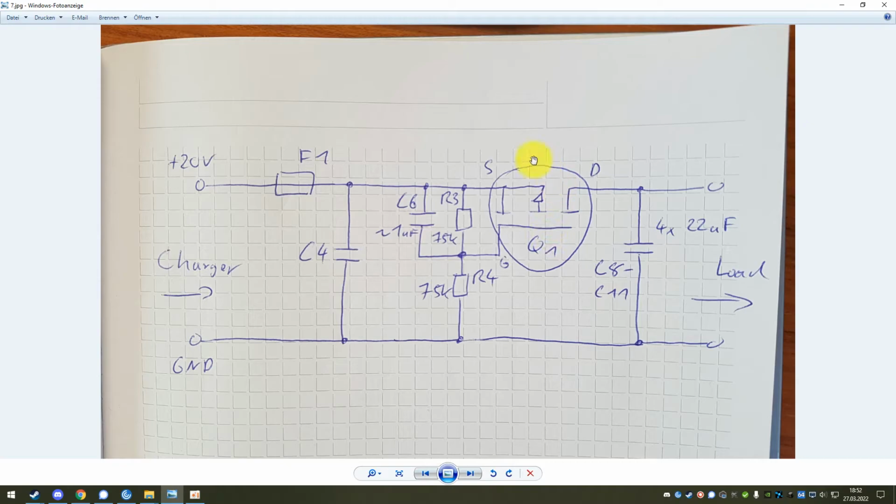When there's a short circuit, this circuit is used a lot of times repeatedly. So this MOSFET is basically the device that receives all the power. All the power that the charger outputs until it detects the short circuit doesn't really heat up the capacitor, because that's a dead short. It heats up this MOSFET when it's in its linear region, so when it's trying to limit the current. So this MOSFET sees a lot of power over time, and it's just not rated for that.